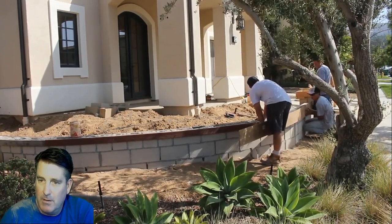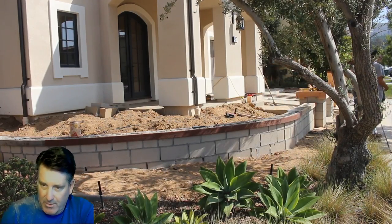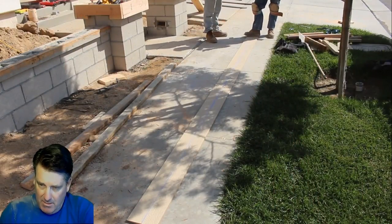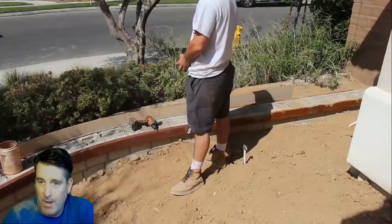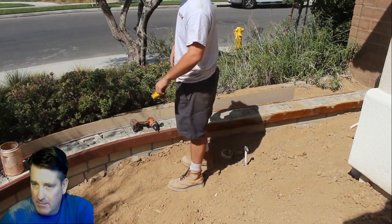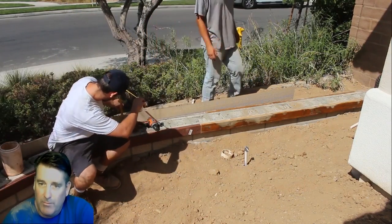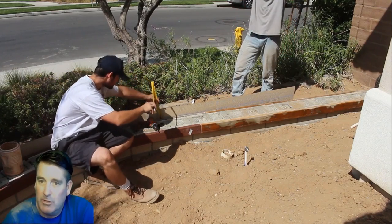Here's the siding I was talking about. It actually has a wood-grain finish on it and I'm putting that to the inside. You can actually use this as a finish itself — pour it, vibrate it, pull the form off and it looks like wood, and you can add dyes to really simulate wood grain. In this case I just turned the wood grain to the inside because it has a finished surface the concrete won't stick to as easily. On the other side it sticks to the concrete and when you go to pull the form while the concrete is wet, you'll knock chunks off.